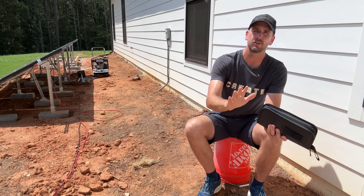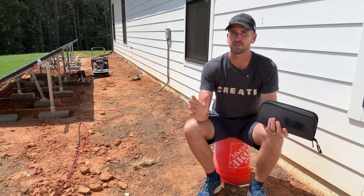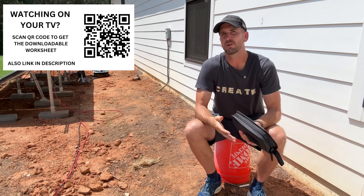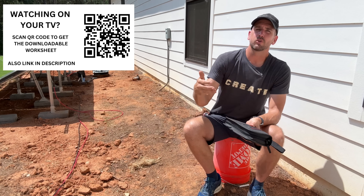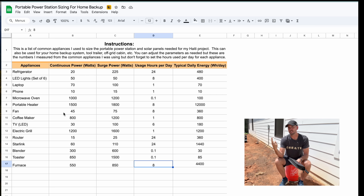You don't have to go at this alone. I put together a worksheet that hundreds of people have downloaded — there's a link in the description or a QR code you can scan. It walks you through the three main factors: what continuous power needs you have, what surge power needs you have, and what the 24-hour energy consumption is for your home during an outage. There are other things to consider, like how much solar input you need for a resilient multi-day system, but those three factors are a great starting point.